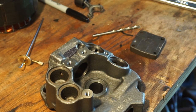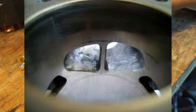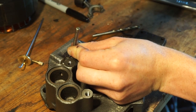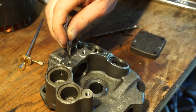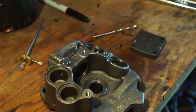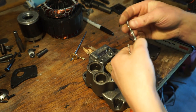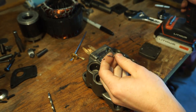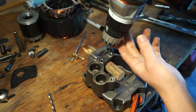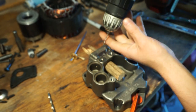I'm thinking I actually want two intake and two exhaust holes. Small engines often have two or three exhaust holes, or one super wide one. Since we can really only drill holes, we're going to make two. I'm using an old drill bit I sharpened as a center punch since I don't actually have a center punch. Let's put a piece of wood in here so that when we drill through, we don't hit the other side of the cylinder. You want to start with a smaller drill bit and then work up to your larger one — so starting with something like a 1/16th before going to 3/16ths. Since this is cast iron, you really don't need to use coolant, especially just for drilling.